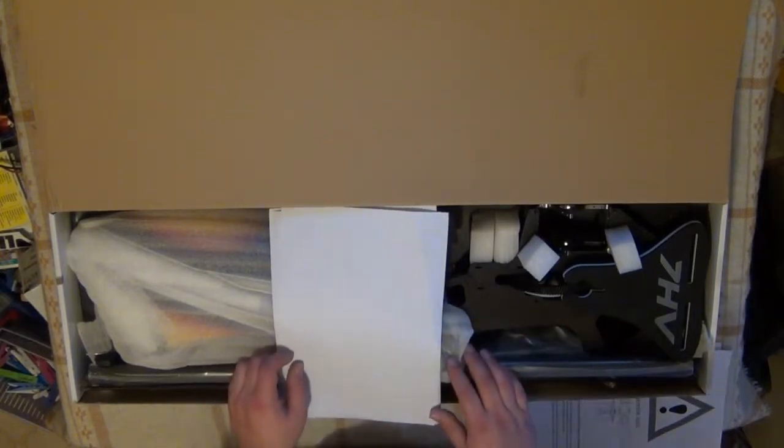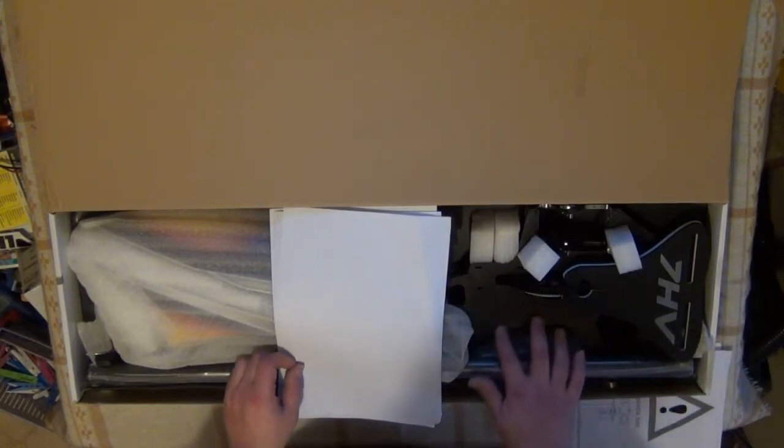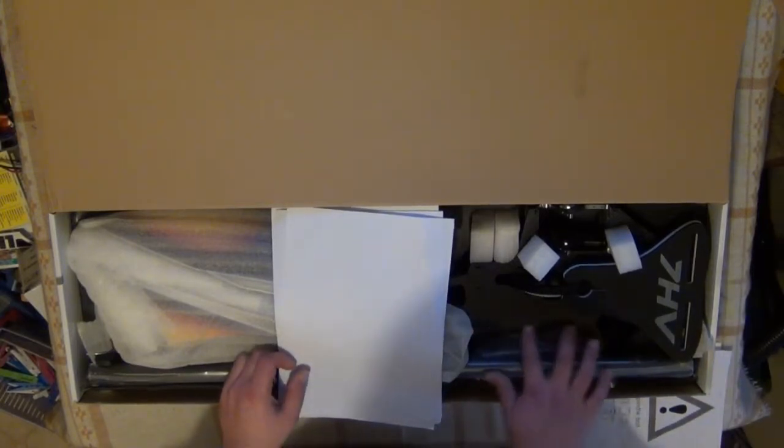Anytime I get a pre-built kit or a kit, I like to start from scratch and pull everything apart and make sure everything's thread locked. I also like to file off the edges so you don't get any chafing with your wiring and possible short circuits.